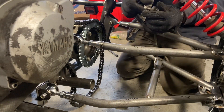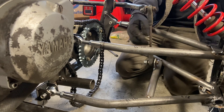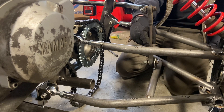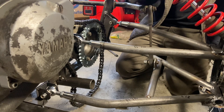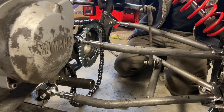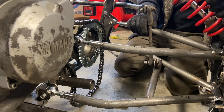Let's put her in and see how she looks. There's one, and there's two. Now, you'll notice this has a slight angle to it. I do that because the track width of a four-wheeler is 45 to 50 inches and the track width of ours is around 60 inches. So if I can steal an inch or two to get a little more action out of this sway bar, I'm definitely going to do that. I'm going to button up the other side — make sure to finish your welding. We're getting very close to final welding of the chassis.